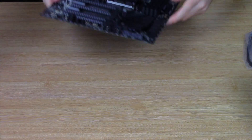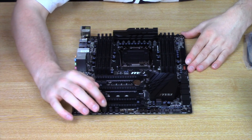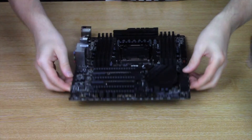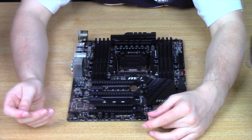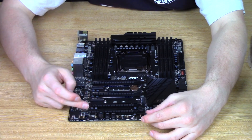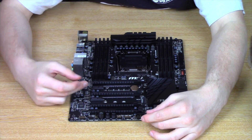So let's have a quick look at the board. Down at the bottom there is a power button and a reset button. You have your SATA and SATA Express ports, and your USB. There's a fan header. There are four PCI Express x16 slots; however, the bottom two look like they're only wired electrically at eight times, so these will be x8 rather than x16 even though they're in the x16 form factor. There are also two x1 PCIe slots and your two x16 slots.